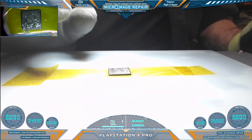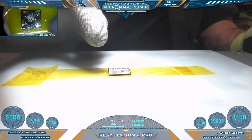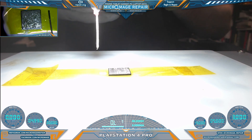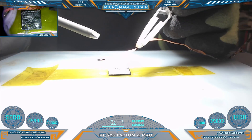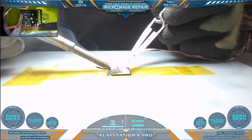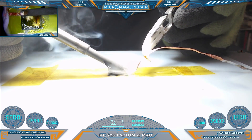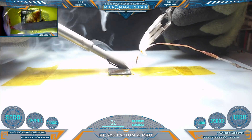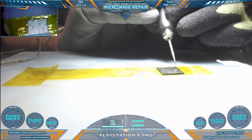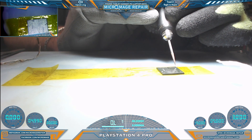In order to work the chip I need it to stay in one place. I've used the tried and true Kapton tape, sticky side up — stick the chip to it, tape it down so that we do not have a chip moving around while we're trying to clean it. Be as quick as we can. The same things apply to the chip as to the board — you just want to glide, no pressure hardly at all except what's necessary to keep the wick on what you're trying to wick. I'm going to grab my pin grinder and we're going to gently scrape up these oxidized pads with the gentlest, lightest touch.